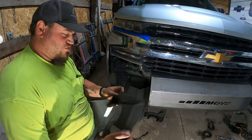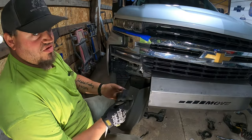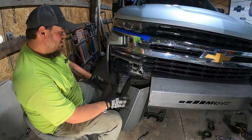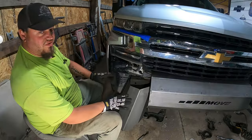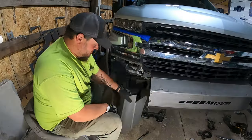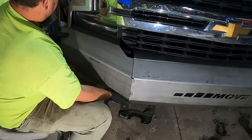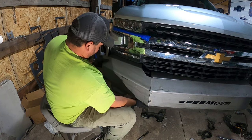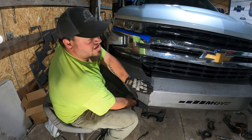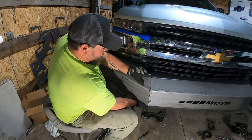This is one of the trickier pieces to fit. With two people it's pretty easy, but it's just me out here tonight. This style of Chevy with its fancy little air vent — the bumper actually comes out past this, so we'll be really careful not to damage any of this paint. We're really trying to line up right here, and then the first thing we'll do is tack this. We'll check visually to make sure it's all good, then tack below and move on from there.